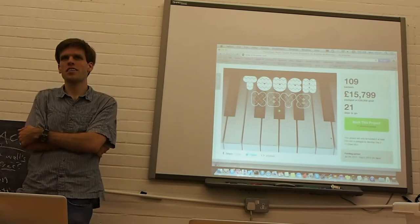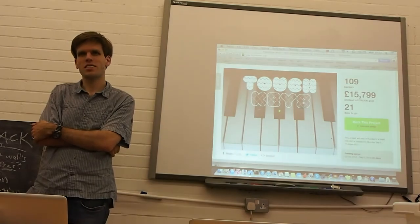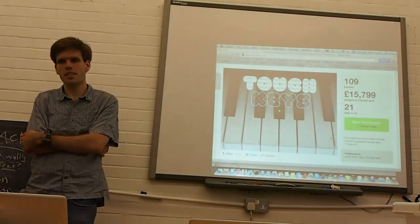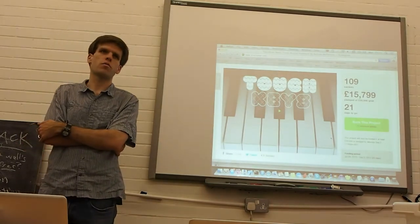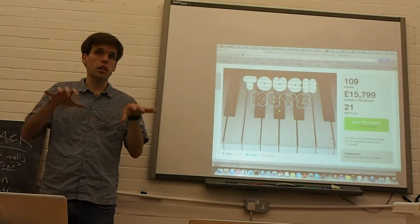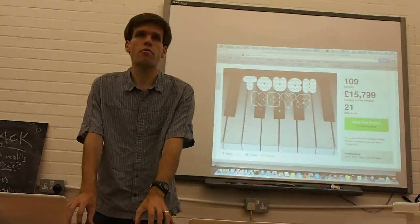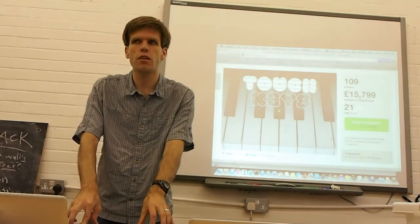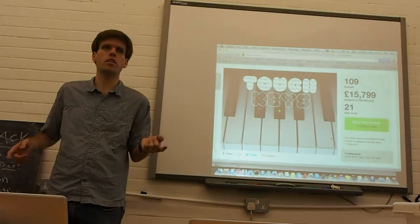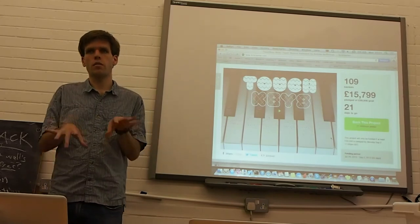So your device, you said there was a feature that was quite unique to the CS80. Can your device emulate that? Yes. The sounds are quite neat, but they've been emulated very nicely by the company Arturia. The playing feature that was unique, or relatively scarce, is polyphonic aftertouch, where every key measured its pressure independently. You just can't buy keyboards anymore that do that. Although there's another crowdfunding campaign out there, not mine, by a company in Germany that is trying to make a keyboard that resurrects that feature.